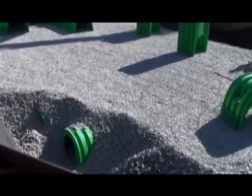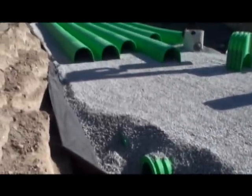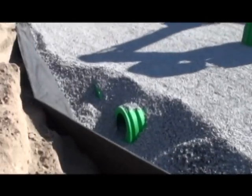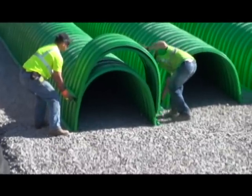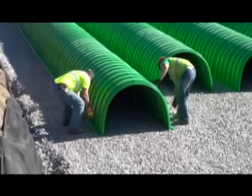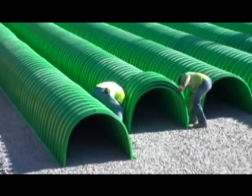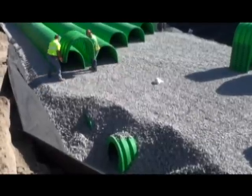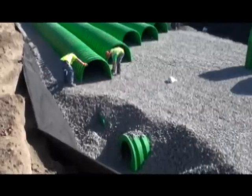This overview shows a proper chamber placement and backfill scenario. Note that the stone has settled down between the chamber rows, securely anchoring the chambers and leaving no gaps. The importance of site preparation cannot be overstated. When the base layer is smooth and level, chamber placement is simple and efficient. Utilising the specified backfill material ensures that the chambers are properly supported and will maintain proper alignment both vertically and laterally. Here the proper orientation of chambers in a double-stacked installation — 90 degrees between tiers — can also be seen.